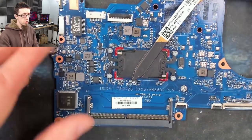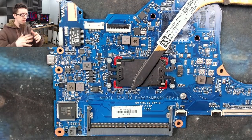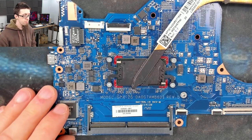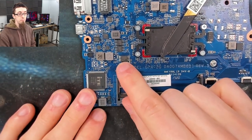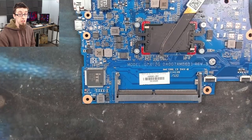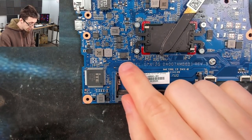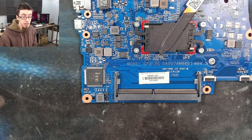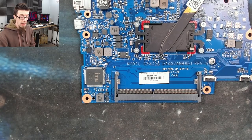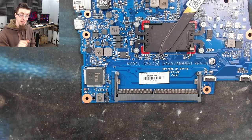The Samsung was quite an adventure because we had to deal with two chips, break down and rebuild our image, and so on. So the first thing we're going to do is get a dump of what is currently on this BIOS chip — we need to back it up before we do anything with it. There are two ways we can interface with this: we can desolder it from the motherboard and put it directly into a reader, or we can attempt to use a clip for in-circuit flashing.